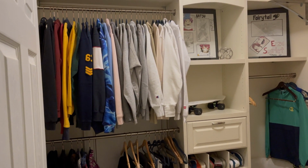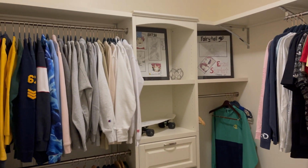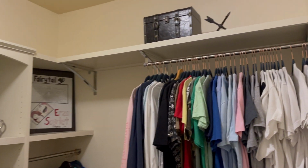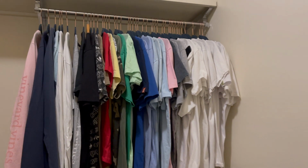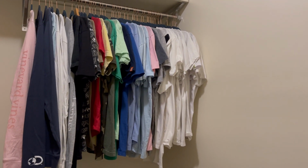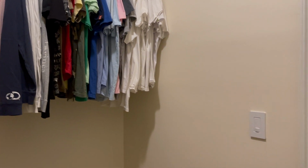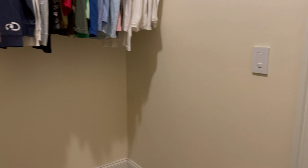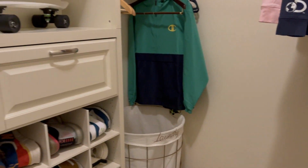It took about 3 days because I started in the evening on day 1 by removing all of the metal shelving and then patching the holes with Drydex and letting that dry overnight. The next morning I got up and sanded and then painted the walls, and that took about 2 coats and 1 gallon of the Lowe's paint in the satin finish.